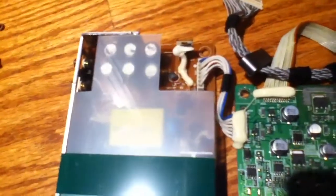First thing I looked at was the power board here. The caps look good — none of them are bulging or anything. Same with the filter cap down there under the plastic, that one looks great. Caps on here look excellent. No burnt resistors, nothing really to speak of, even on the bottom.